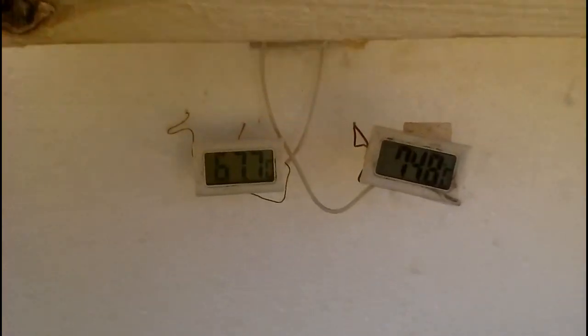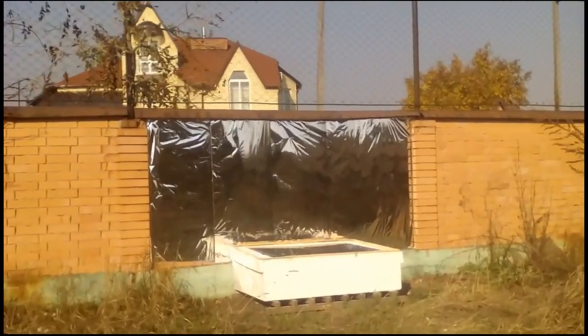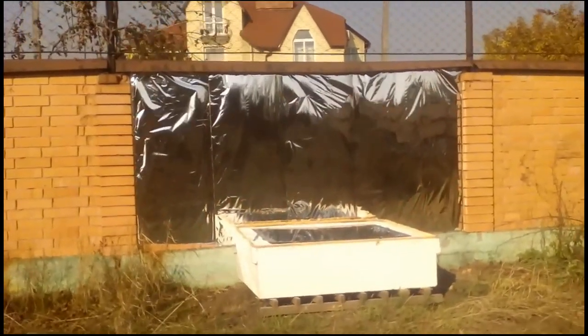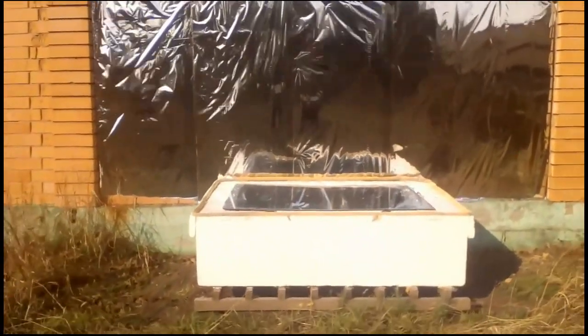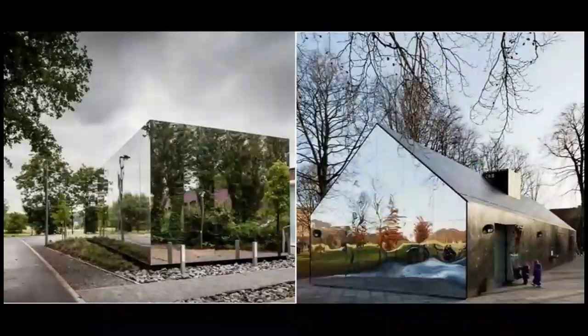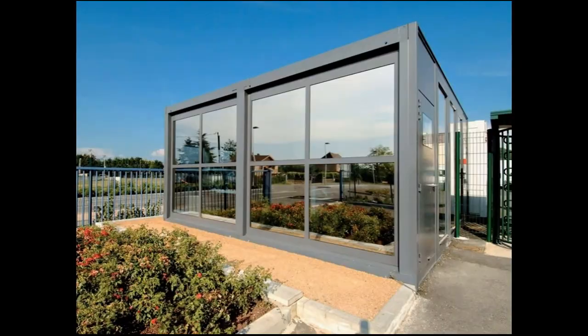For example, now we see that the sun heated those 100 liters of water to a temperature of more than 70 °C. I am now showing the idea of a solar heater without that cover, and the mirror is this cheap reflective film, which can be fixed on a fence or on the south wall of a house. Obviously, a similar effect will be under such walls or fences lined with sheets of mirror stainless steel, or under such mirror windows.